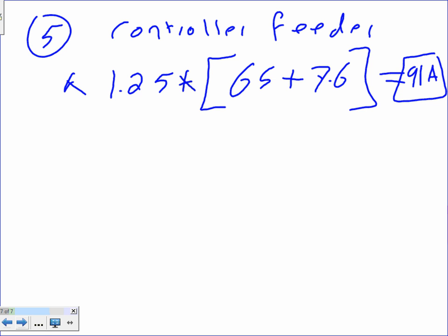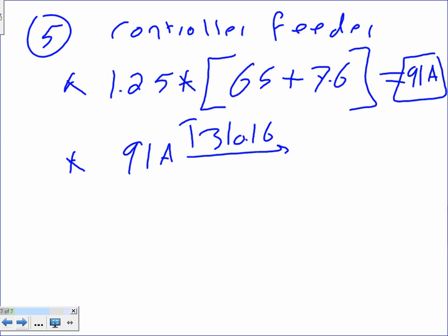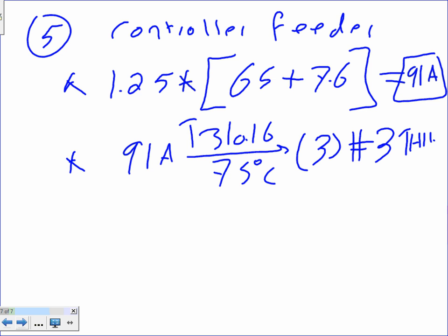91 amps. So you take the 91 amps, where are you going to take it? To 310.16, soon to be 310.15(B)(16), under the 75-degree column because they're motors, and I end up with 3 conductors because I care less about the neutral. 3 conductors, THHN, or for other installations in the area you might end up with THHW because of the water and so forth. Don't worry about the insulation type. Or RHW is a common one.